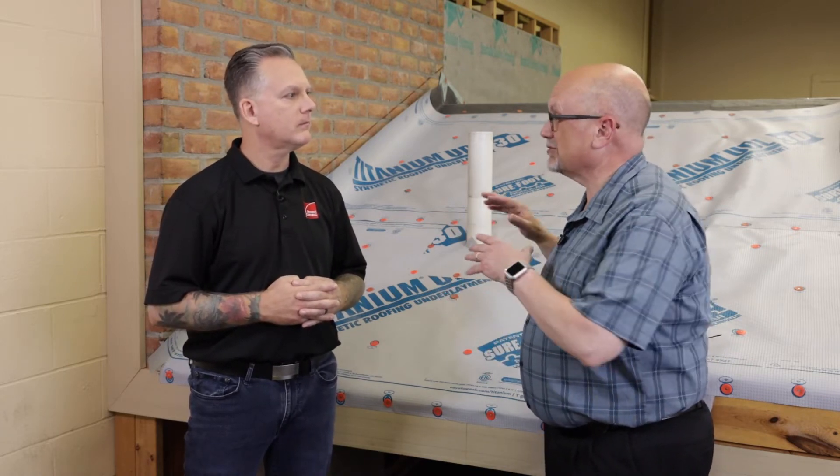As far as the general application process, you certainly want to make sure you start with a clean deck — no debris that's going to interfere with the underlayment application. Before we start applying the product, if we have any punctures or tears in the underlayment, we seal over those with a new piece of underlayment that's properly applied and tucked up under the next highest course of underlayment.